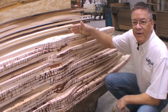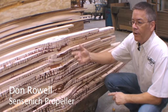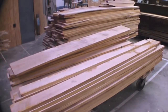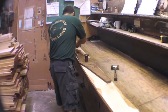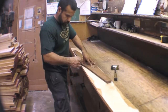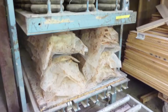All of our blanks are manufactured from laminated birch. They can have any number of different laminations — from four, up to six or eight — depending on the propeller design. The wood is selected based on color, grain, and the lack of knots, and then the patterns are laid up and marked off based on the different prop designs. Once the boards are selected, they are planed down to finish thickness and then laminated using resorcinol.